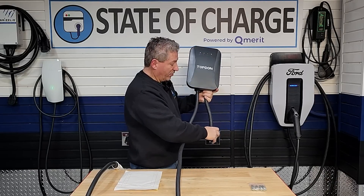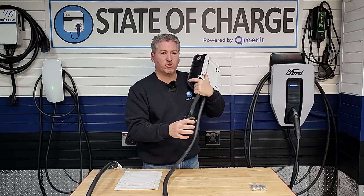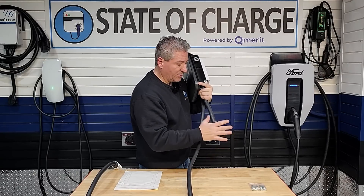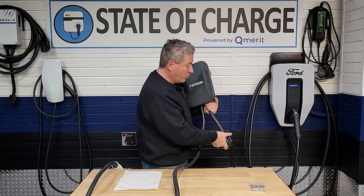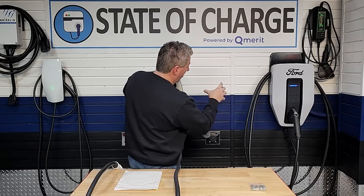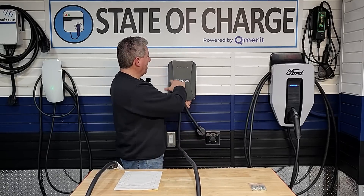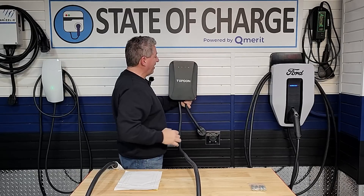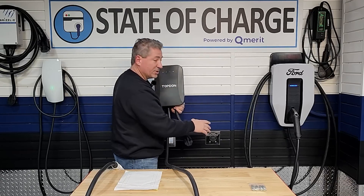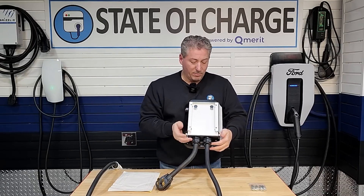If you're mounting the unit on the wall and the outlet is below, make sure your electrician installs the outlet with the ground pin facing down, because the ground pin will be on the bottom. Sometimes the ground pins are on top depending on how you mount it. You could mount it the other way — in that case the ground pin is up — and you'd install your NEMA 14-50 outlet around 48 inches from the ground, with the top of the unit about five feet up, or the outlet around 38 to 40 inches from the floor.